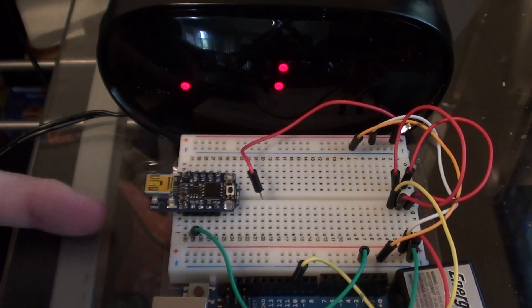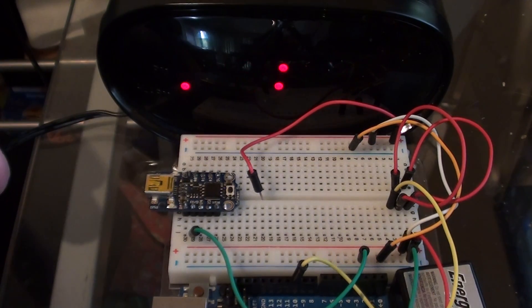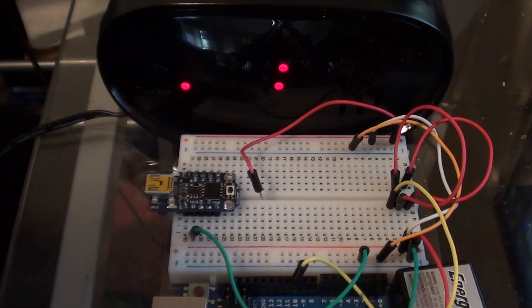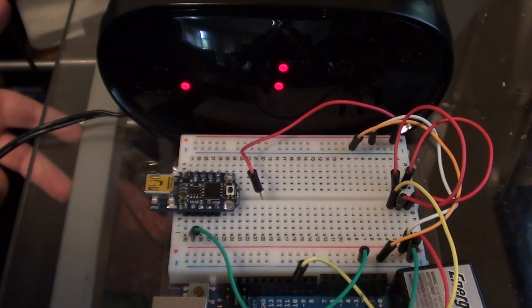The code starts up a player which feeds a medley, basically, into a routine which varies the 96 MHz PLL frequency just a little bit, thereby frequency modulating the signal like most radio stations.